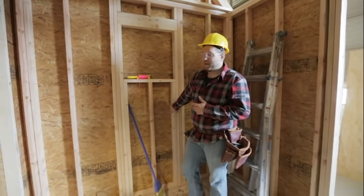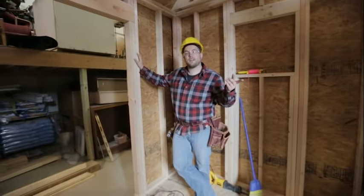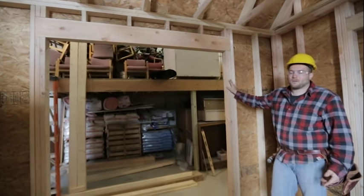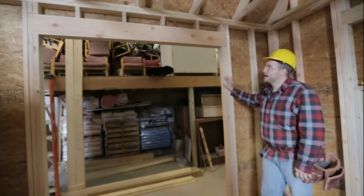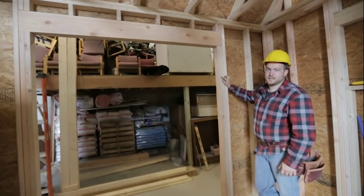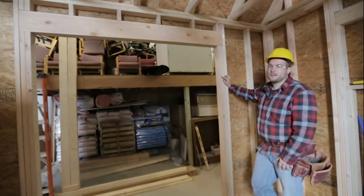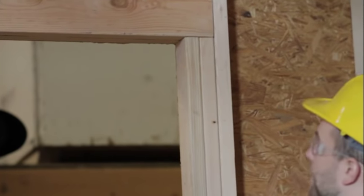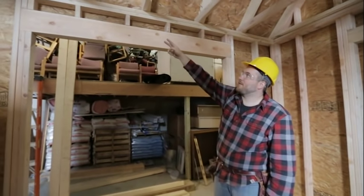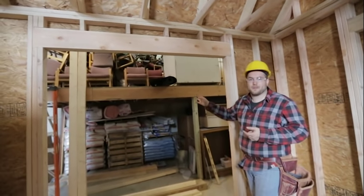The difference between the front door and the back door is the wider opening. If you're doing a bay window or, in this case, a patio door, and you have an opening over six feet, you need to have two shoulder studs. If you get toward an opening like 17 or 18 feet, like a garage door, you need to think about a triple shoulder stud. We also beef up the header a little bit — we have three rafters that this header is carrying, so we need a heavier header. We'll talk about that when we lay out the wall.